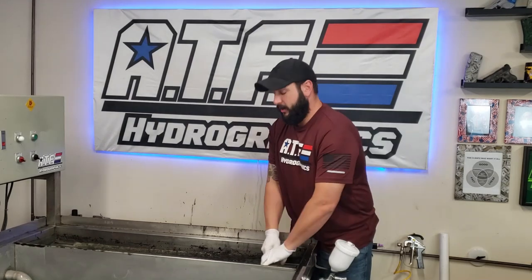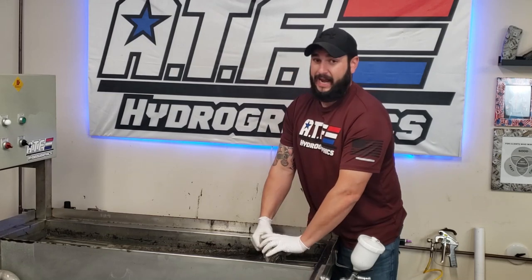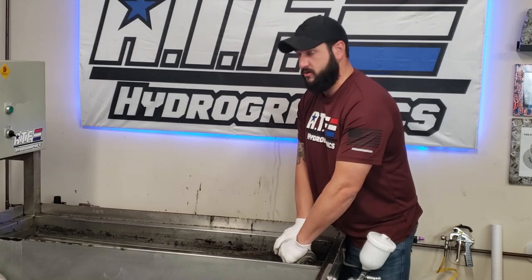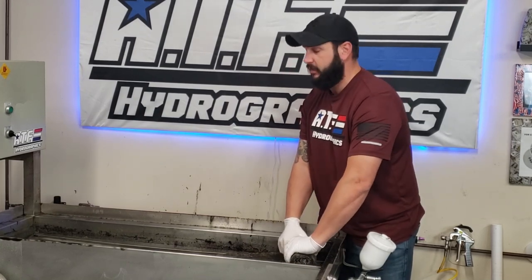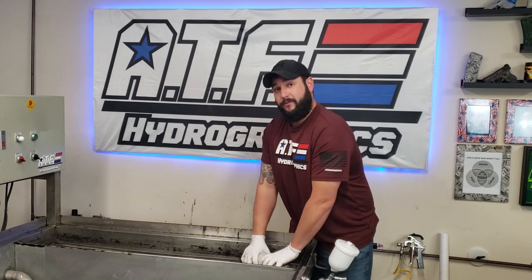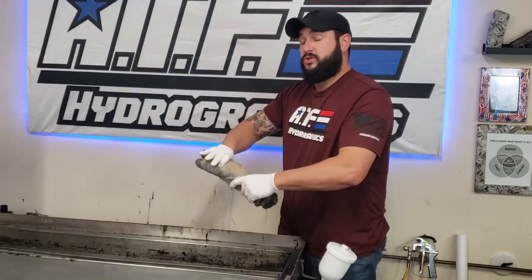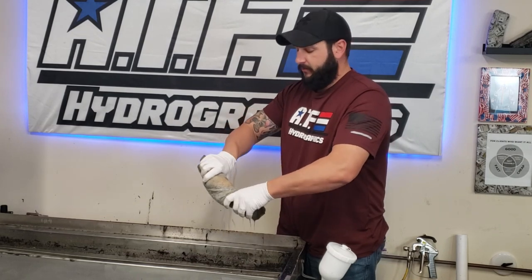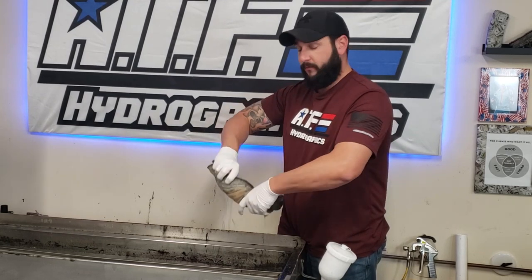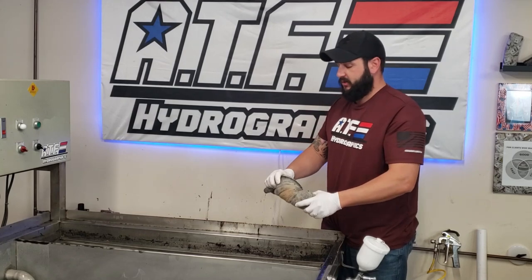So hydro dipping is hard enough as it is. There's so many variables. You got different paints, manufacturers, different kinds of paints, metallics, and different kinds of activators. There's a ton of different film manufacturers, and some thick films and some thin films. And there's just so many variables, it's really hard to be consistent. So every opportunity that you can take to stay consistent will help you out in the long run. So simple things that you can control the consistency of will help you out big time when it comes to figuring out what you need to change to get something to work that's not working right for you at the time. And water temperature is one of those really, really easy things to keep consistent.